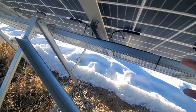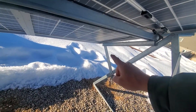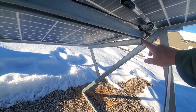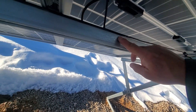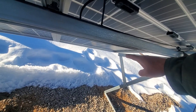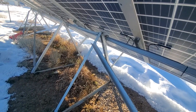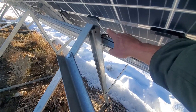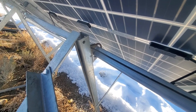This whole thing pivots, so what we need to do is loosen this up — we just take those bolts out. You'll notice that this cross member sits on the frame that supports all the solar panels, and when that tilts, we tilt the panels for our two different angles. This is just an exhaust bracket that acts as a swivel for the Unistrut.